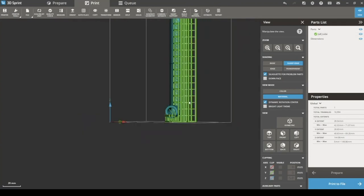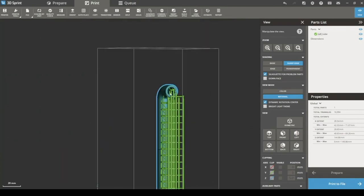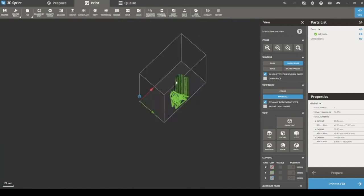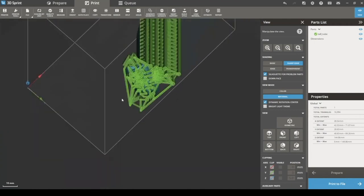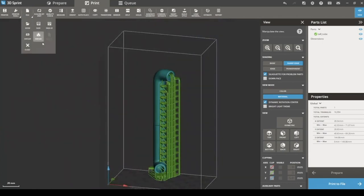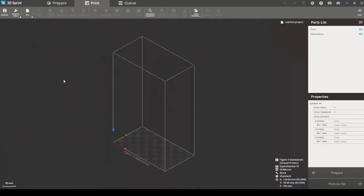We jumped around a little bit there on the round circles, but the important thing to pick up from that is knowing that you're supported above and below the hemisphere. And the other takeaway here is to be sure that you've covered that center line on the bottom of the part when you start a round surface. And we're going to go in now.